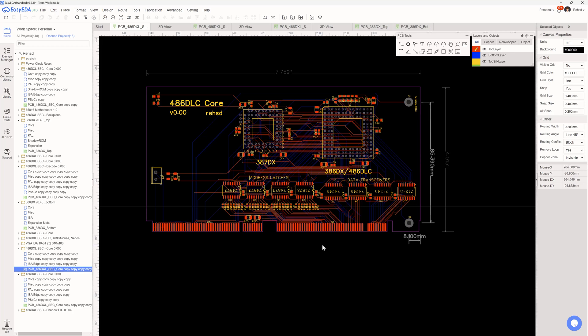That's it for now. The next update will hopefully be a cleaned-up version of three or four of these cards plus a backplane. I have a lot of work to do: split out and set up schematics, lay out the PCBs, do quick test fitment, check the physical connection into the backplane, verify the bracket position, and maybe print everything out on paper for a better feel. Then maybe as a Christmas present to myself I'll order up a bunch of PCBs.